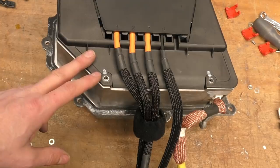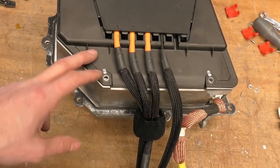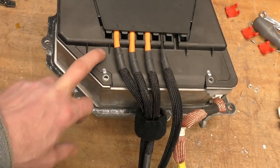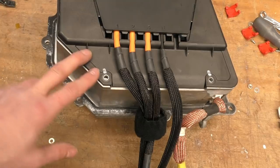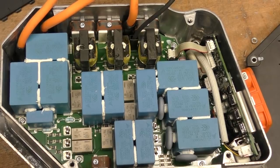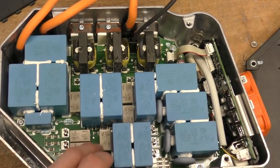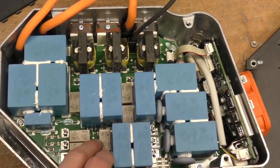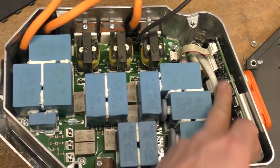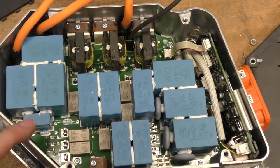Because of the issues of the motor being used as part of the charge circuitry, it's quite fussy about earthing — so it does an earth loop impedance measurement between earth and neutral to verify the earth connection is good before charging. Inside this, my first thought was 'what the hell is going on here' — loads of capacitors as expected from filters, some inductors, but also six relays. These are like five amp relays so they're not carrying the main current. There's also a board with quite a lot on it.